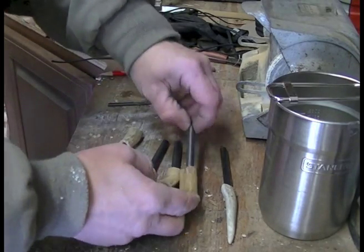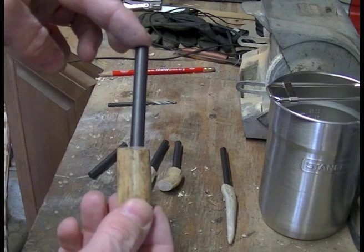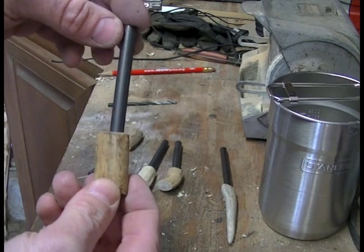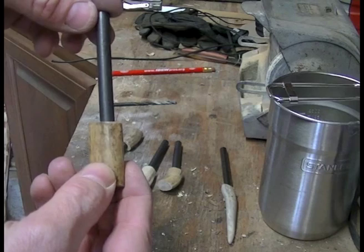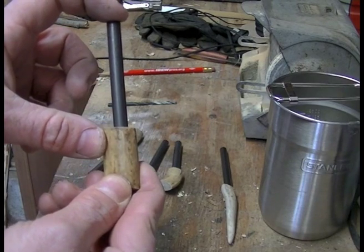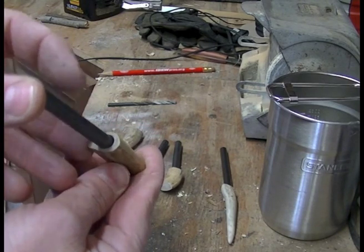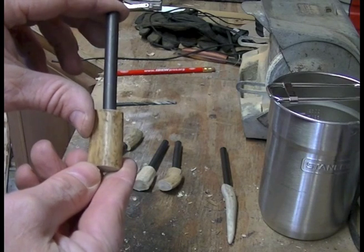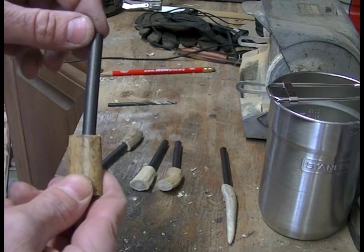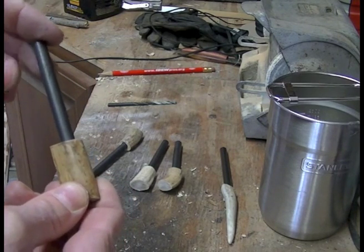One thing I do want to show you is this one right here. Now, for me, this one doesn't look 100%. The lines are off on it. It looks to me like it should have been more to the left a little bit. So what I did is I reamed the hole out, and now, maybe it's just me, but I don't like that look. I do like that look. Okay, so it's just a little bit of a gap in there, and I'll be able to put some of that material that I saved in there with the glue, and if I put it in my vise correctly, it'll keep that line together. I don't care for the ones that look all crooked and are just not mated up very good. So anyway, that's a way to fix that if you need to.